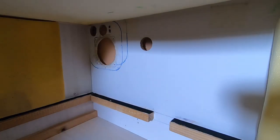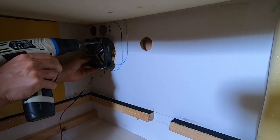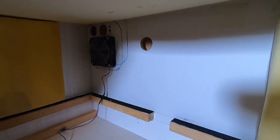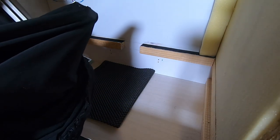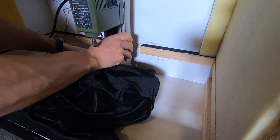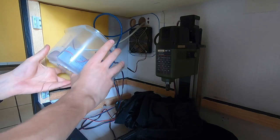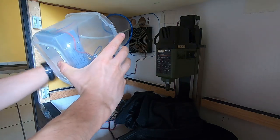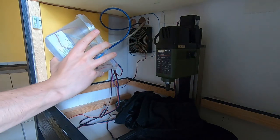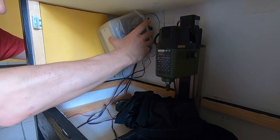Back to the case. In the back, I've made provisions for the electronics. A computer fan provides cooling for the Arduino and the drivers and their power supply. The machine sits on a foam mat to limit the noise transmission to the case. The electronics go inside a separate box — I went the lazy way and used a food container, so I wouldn't exactly call it an electronics cabinet. The fan circulates the air directly with the outside, completely isolated from the interior of the enclosure.